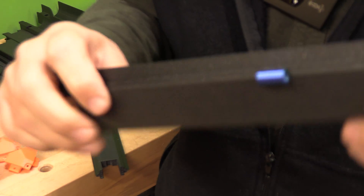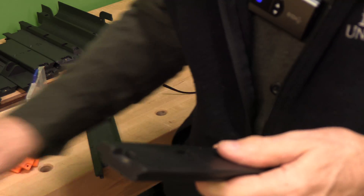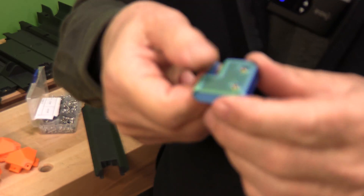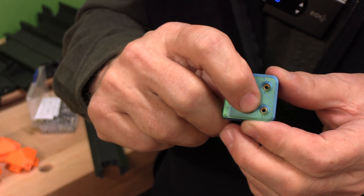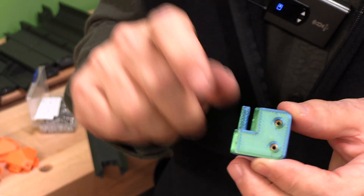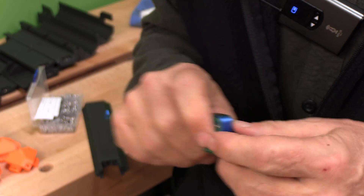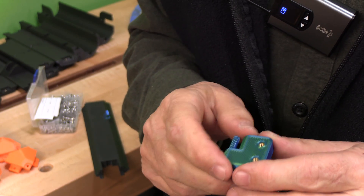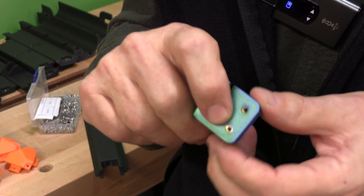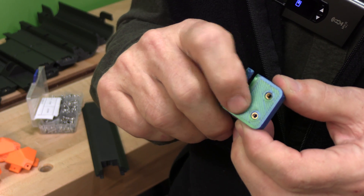Here they are — the hinge posts — but I made a small mistake. If you insert these threaded brass heat inserts too deeply, you may need a longer screw, which I did, but fortunately I have some other three millimeter ones that are a bit longer. So just be careful not to insert these heat inserts too deeply.